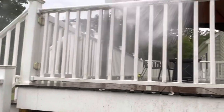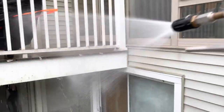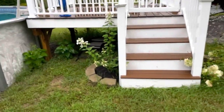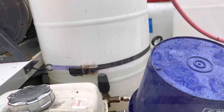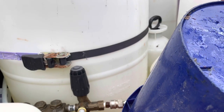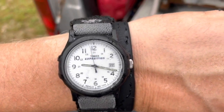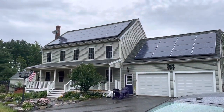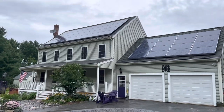If I burn a leaf or two or a flower or two, it's going to have no consequence. So that's like 10, 15 minutes — 10 minutes, I'd say, of dwell. No rinse yet. I'm just going to rinse these faces real quick, and then all the rest of this — we're done. That project took me — that's my SH tank right there, and that bottom banding line on the tank is a 20-gallon line. We've got about 22, maybe 23 gallons left in there. This wash took me about 8 gallons. It is 9:15, 9:20, and I got here at 8 o'clock. The house is done — came out beautiful. Solar panels all rinsed off nicely with our triple rinse technique that we like to use. And I'm out onto the next one.